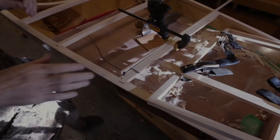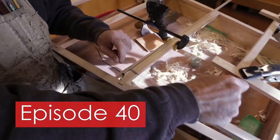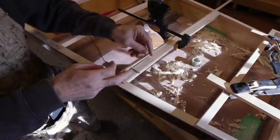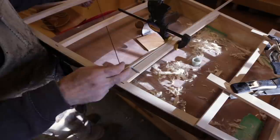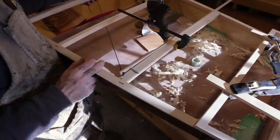I'm just playing around with an idea for a pin that will release this hatch cover. We were going to use some little door stops at first, but my client would prefer something that's a little more positive. I was playing around with this idea using some polycarbonate, but it just had no life to it — it felt like it was going to slowly give up in a short amount of time. So I've come up with this idea, which is a really old idea actually. I use these on door latches going back through history, hundreds of years, just using a wooden spring.